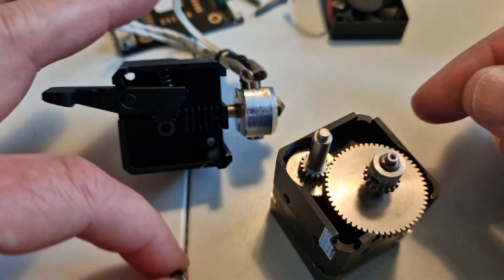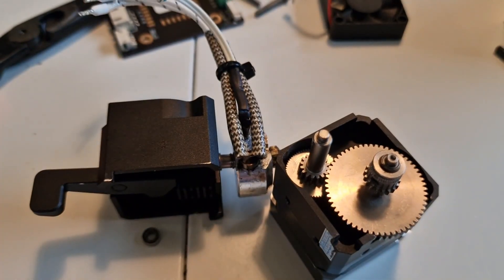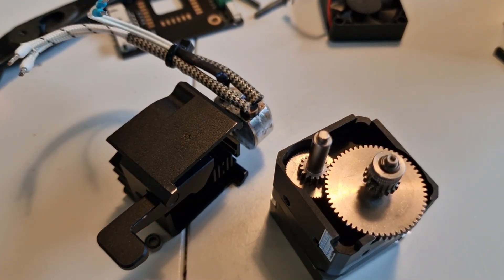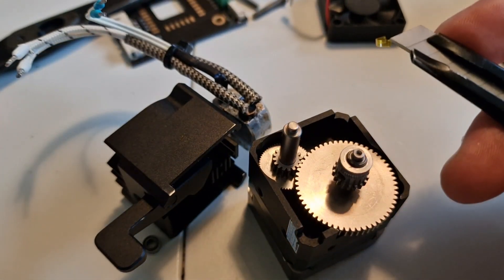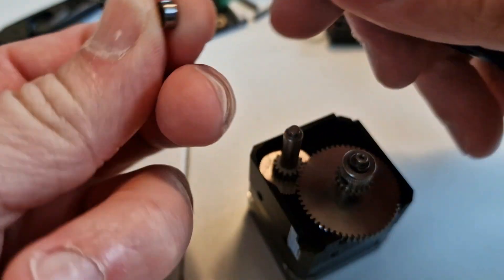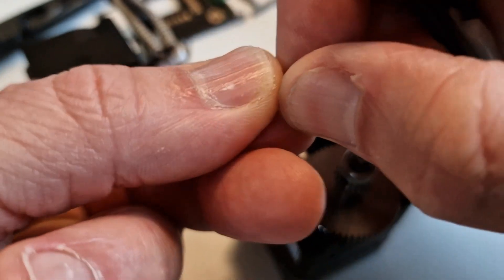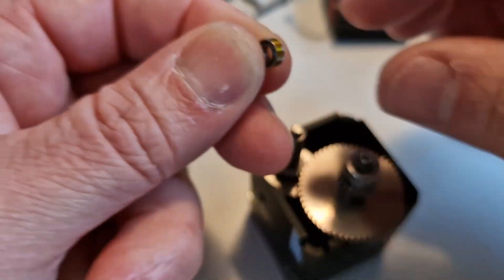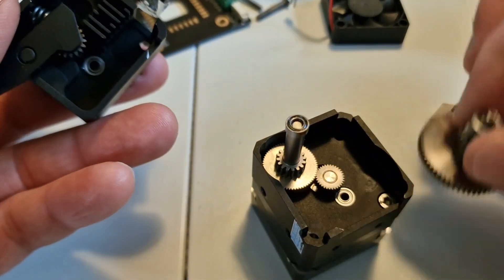What my fix is — I'll show you. I take the bearing and I get some Kapton tape. I cut very tiny strips. I have this tiny little strip of Kapton tape, and then I wipe the grease off the side of the bearing. I literally just put a little bit of a shim onto that — right on the edge. So when I go and insert it into the hole, it actually wedges in very snug into its seating hole.